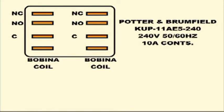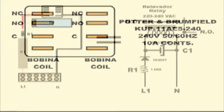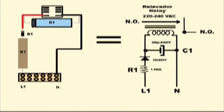This schematic diagram shows the configuration of the relay terminals. The two terminals shown below correspond to the coil. The rest are the contacts that will turn the refrigerator on and off. This other drawing shows all active elements connected in series: resistor R1, diode D1, and the relay coil. The capacitor is in parallel with the relay coil, and together with the diode, it prevents the vibration of the relay contacts.